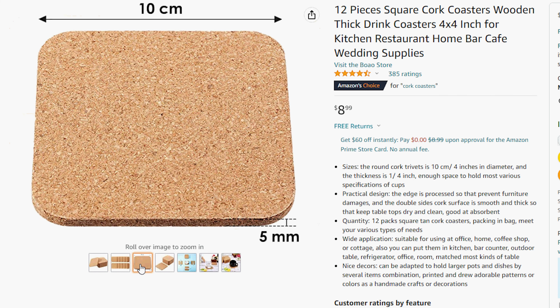Now it was time to get lasering. Before putting the chipboard in the laser, I marked what would be the top left corner — this isn't necessary, but if I removed it and wanted to use it later I'd know the correct orientation. I focused the laser on the chipboard, then backed the laser head off a little by defocusing the lens slightly — this gives a slightly wider, more obvious mark on the chipboard. The job was then sent from CorelDRAW to the laser software, and then from the laser software to the laser, and the squares were marked on the chipboard.